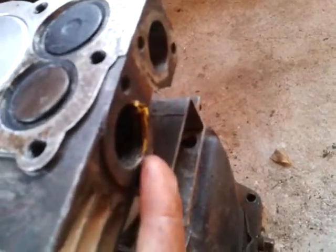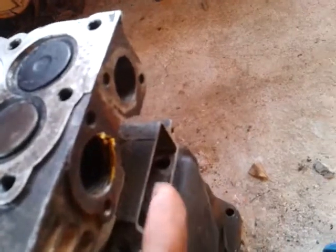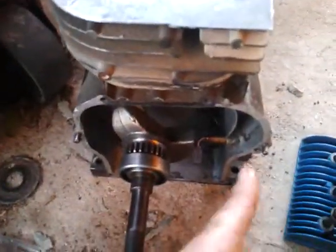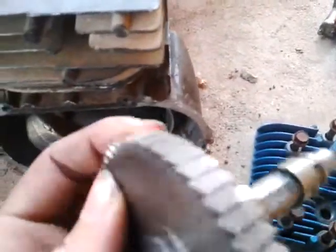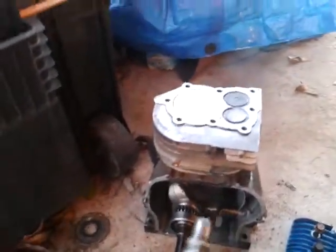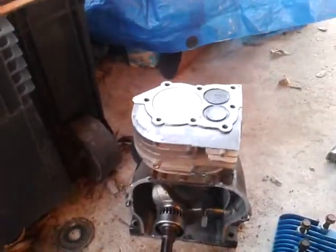So if you do that, you should be good with the engine. And you just put an air fitting right here — a valve or something — and put a flywheel on; of course, this one doesn't have one. The engine is going to run backwards, but it will run. So you just need to time it correctly, have the lobes on correctly — one in the front, which is already there, and then put one in the back — and it should run fine. So there you go. It took a couple of takes, but I hope it helped my subscribers. Thanks for watching.